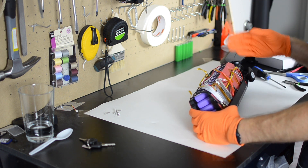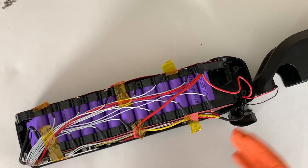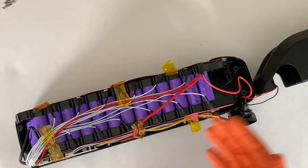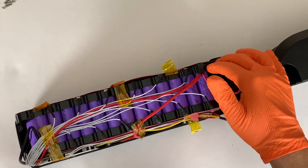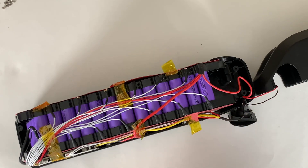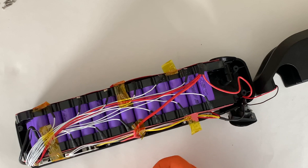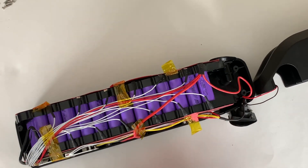So there's no external temperature probe somewhere in the battery that would cut off discharge if the cells were overheating. It's not strictly necessary, but it's something I would have liked to have seen — it's just an extra safety feature that this BMS does not support. Other than that, there's good battery wire management, the cells are in cell spacers, everything else seems to be just fine, and I don't notice any places where wires are being unnecessarily pulled or pinched.